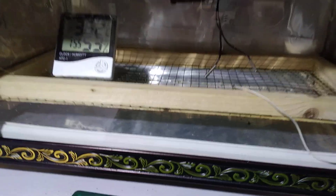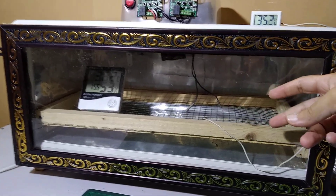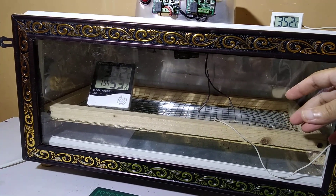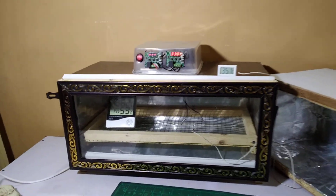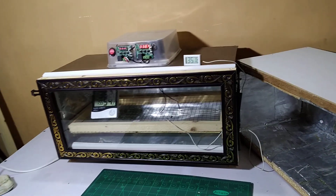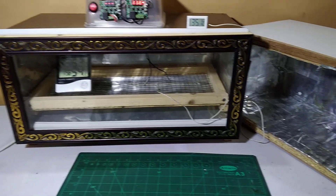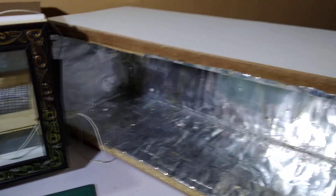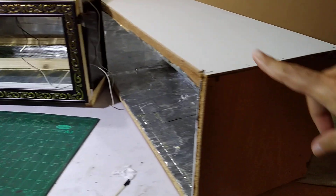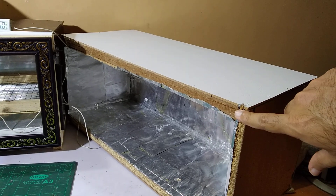On the inside it is a very insulated system, but we have used glass for the fancy look — it's not really useful for heat retention, but I made it only for the experiment to see if it is making any progress with heating. It is working very well, using around 80 watts with about one minute off and one minute on. The box is made from MDF sheet on the sides with a wood structure.